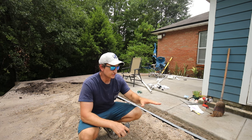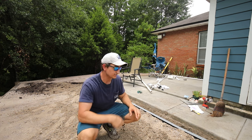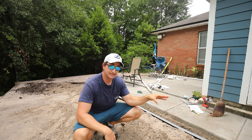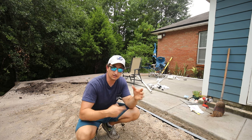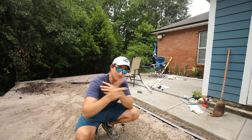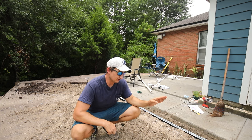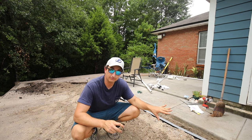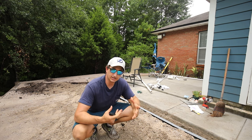The goal here is to have this drain pitched a little bit so the water obviously runs down to the drain exit. I want to keep it about two inches off the existing concrete pad. I've got it set in this corner and I'm going to use a cut piece of drain that's two inches as a spacer, then backfill with cement. That two-inch buffer lets me ramp the water down, gives me some play since the concrete edge isn't clean, helps secure it, and two inches is the minimum thickness for this type of concrete to keep it structurally sound.